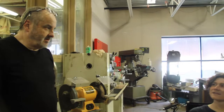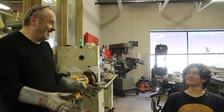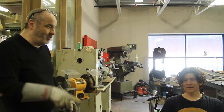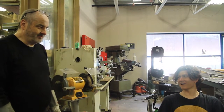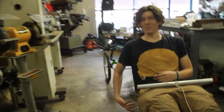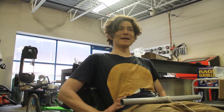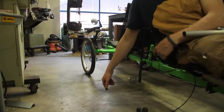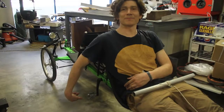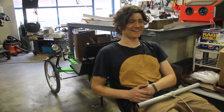68 inches divided by pi is going to be quite big — basically one revolution per stroke, which means a large drum. I might need to do it spiral. The thing is, this is spinning the crank, not the hub itself. Normally the wheel spins about three times faster than the crank, so because this effectively goes to a crank, it's spinning at about one-third the RPM — meaning I'll need a substantially larger drum. I may need to change this so the bulk of the gear reduction happens at a jackshaft rather than the hub, so the drum RPM is much faster — closer to the wheel RPM. That's why we build prototypes.